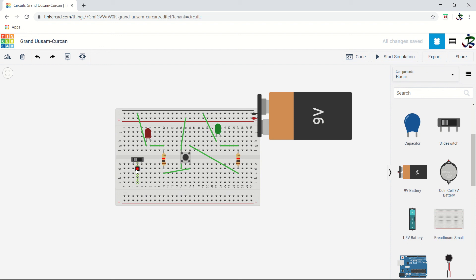First we go back to only the push button — yes, that is working correctly. What we did was take the positive directly and give it directly to both LEDs. So the switch was not controlling the power. The positive will only come when you press the push button and then flow through the circuit. Now let's try for a single LED — it's not working. Now when the slider is this side, this LED should be on and the other should not, but both are getting on — why?